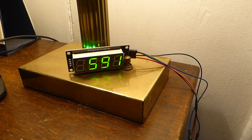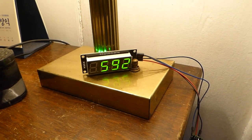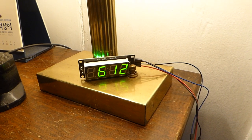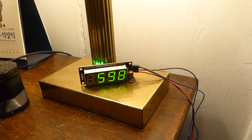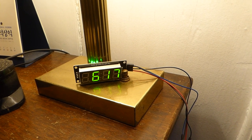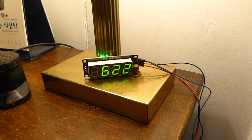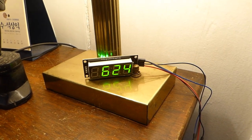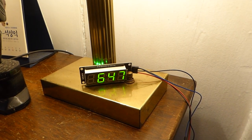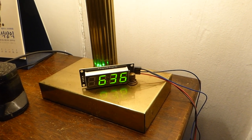I'm targeting about 700 to 750. If I'm trying to warm it up fast I can even get the digital up to about a thousand degrees before the temperature gauge on the stove pipe is showing 450 to 500 degrees. So it's just a much more immediate indicator of the air temperature going through the stove pipe.